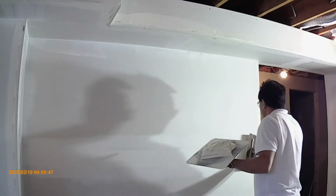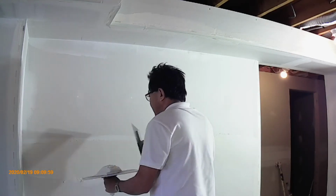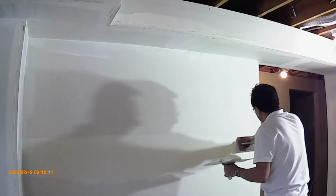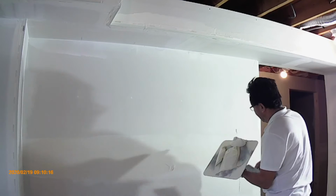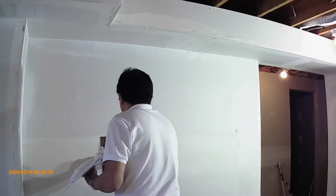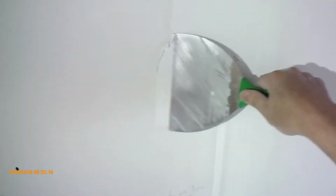Liagle Tapeless Drywall Finishing: we skip the taping process and we only finish one side of inside corners. And we don't need to spread the mud really wide on butt joints. So altogether, we can save about 40% of labor time. And because the gaps are fully filled with tapeless mud, which is fiber reinforced drywall joint compound, the joints are much stronger than joints finished with paper tape.